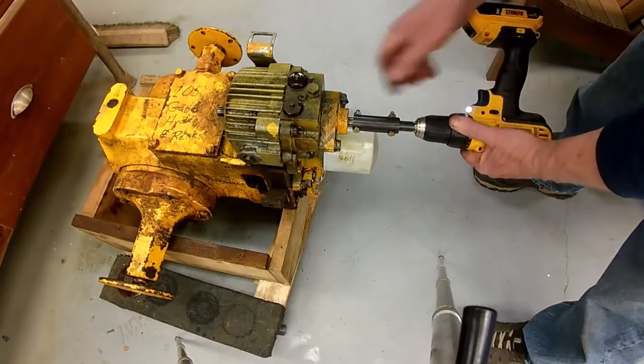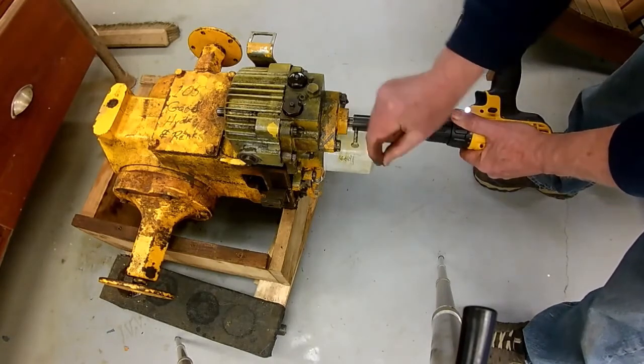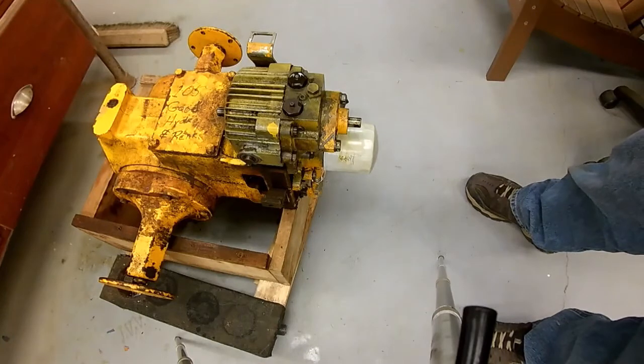The rear axle is ready to be reinstalled in the tractor. If you split your tractor and you're working on it like this, you may have wheels attached to it — it depends on your situation. If you have a wide frame or Quiet Line tractor where you have a tunnel cover between the seat and the dash that's removable, you can actually remove the hydro from the rear end without splitting the tractor, which makes it a lot simpler. Okay guys, that completes the reassembly, reinstallation, and testing of the Cub Cadet hydrostatic transmission. Hope that was interesting and helpful for you. If you have issues with your hydrostat, maybe you'll be able to disassemble and diagnose the problem yourself. That's all for now — we'll see you next time. Thanks for watching.